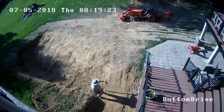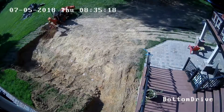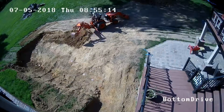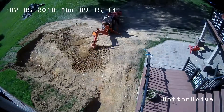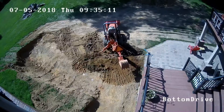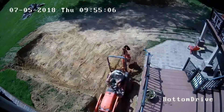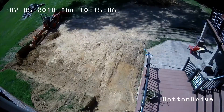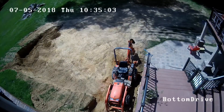I'm getting ready to scratch out the rest of this pad to make it level, just using the backhoe to scrape everything out. I've marked everything with white paint on those little dots using the laser level, and just using the backhoe bucket to get rid of the excess dirt, trying to level things out. I think this is about four or five inches below what that patio is, maybe a little deeper.